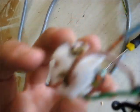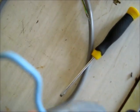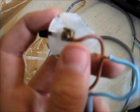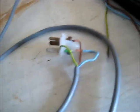If you also have that connection made, push the cord right in. Don't get the insulation caught in the connection because you'll form what's called a resistance joint, which will cause heat build-up and melt the pin on your plug. Now I'm going to push in a bit and twist the wires - always twist them, make sure all the strands are twisted before putting it together so no stray wires pop out. I've got to fix this earth connection up properly.